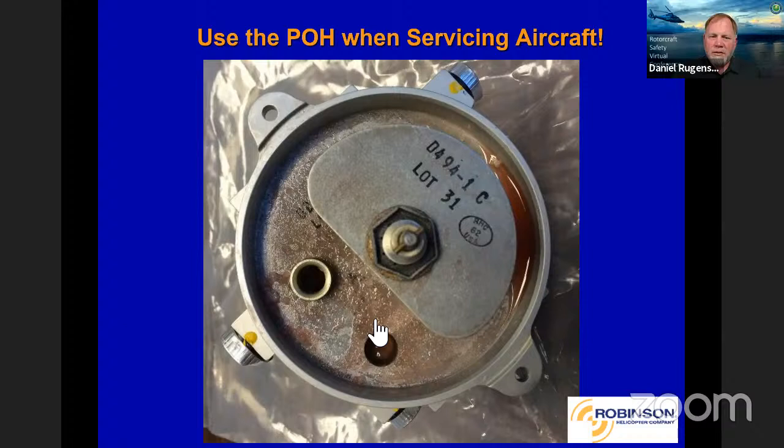And why? He goes, and you're a sprayer, right? He goes, yeah. I just went to the farmer and asked him, hey, you got any hydraulic fluid? And he goes, I got plenty of it for my tractor. So that's what they had put in the system. And of course it contaminated the whole system and caused all the seals to leak and gummed up everything. So just gotta be careful out there what you're using, and especially model specific type stuff between the 22, 44 and the 66. We'll talk about it a little more as we go too.